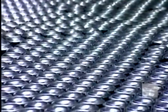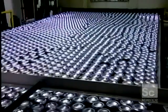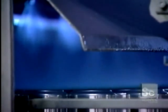The washer performs a six-stage cleaning. The first two washes are in hydrofluoric acid at 140 degrees. The last four washes are in deionized water — neutral water with no pH — also at 140 degrees.